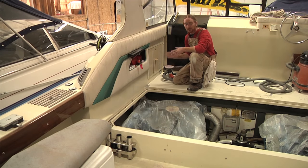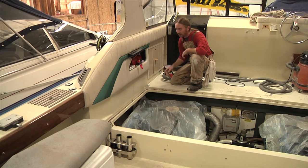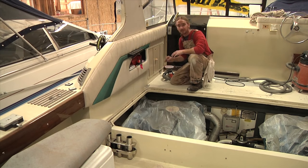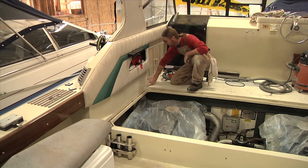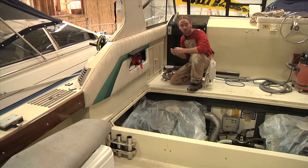For this, I'm going to be using polyester resin rather than epoxy for a couple of reasons. One, because I want a fast cure — I want to be able to get this area turned around yet today. Also, the reason I'm using poly on this area is because this is a radius, and the polyester resin is going to work better with the chop strand matting and make it more pliable. It's going to make it conform easier to this curve — so that's the plan.